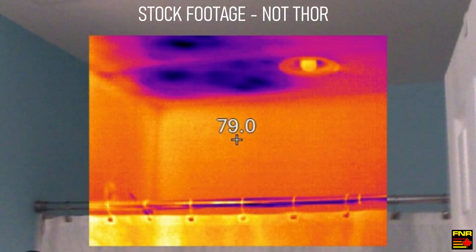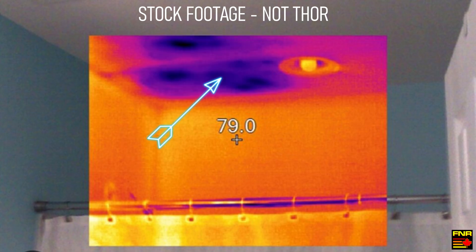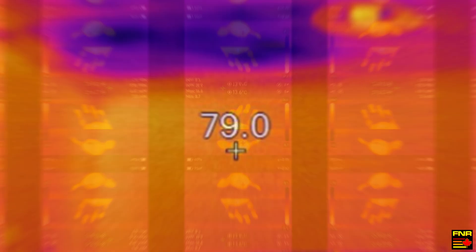For example, let's say you have a leak in your roof. The rain leaking in is colder than the house, so it makes a cold spot where the water pools on the ceiling. Point the thermal imager at the underside of the ceiling, and the leak is immediately obvious because of that temperature difference. The camera is extremely sensitive and can pick up extremely small temperature differences. Here I touch the siding on my house for a split second, and you can clearly see the warm spot where the heat from my hand warmed up the plastic.